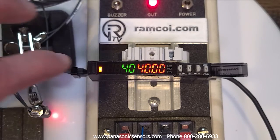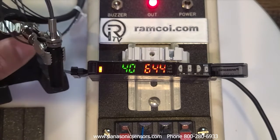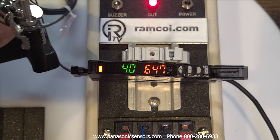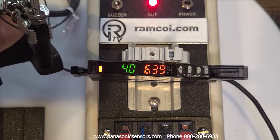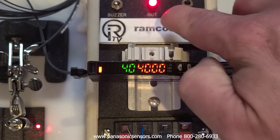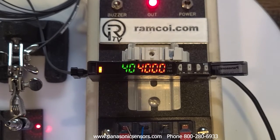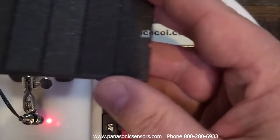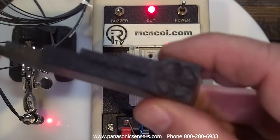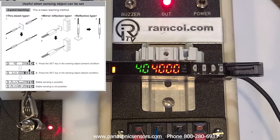What I have here is a fiber optic cable, the FD-42G, connected to an FX-MR2 focusing lens. That focusing lens allows the beam to go down to a fine spot, and the spot size can be adjusted by how far the lens is threaded on. The output of the sensor goes into a little LED light as an indicator. For a target, I have a stair-step piece with our old Ramco logo. Let's teach the sensor.